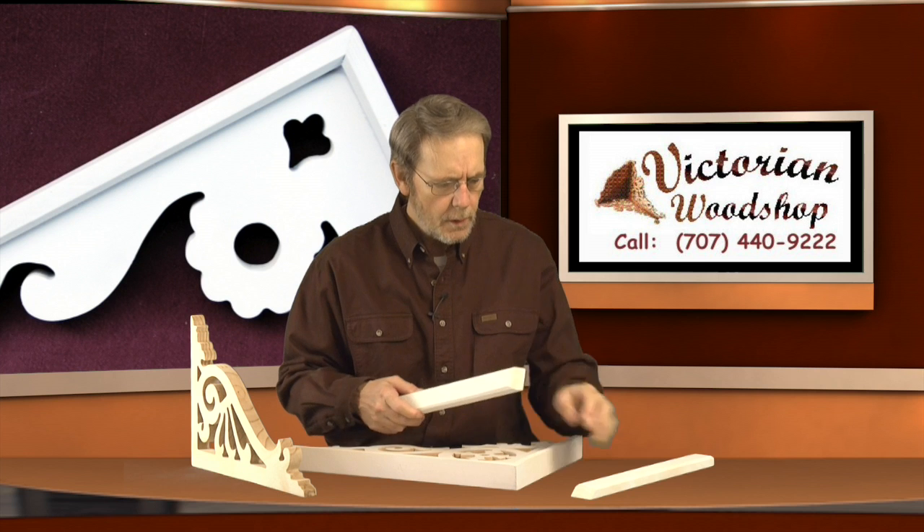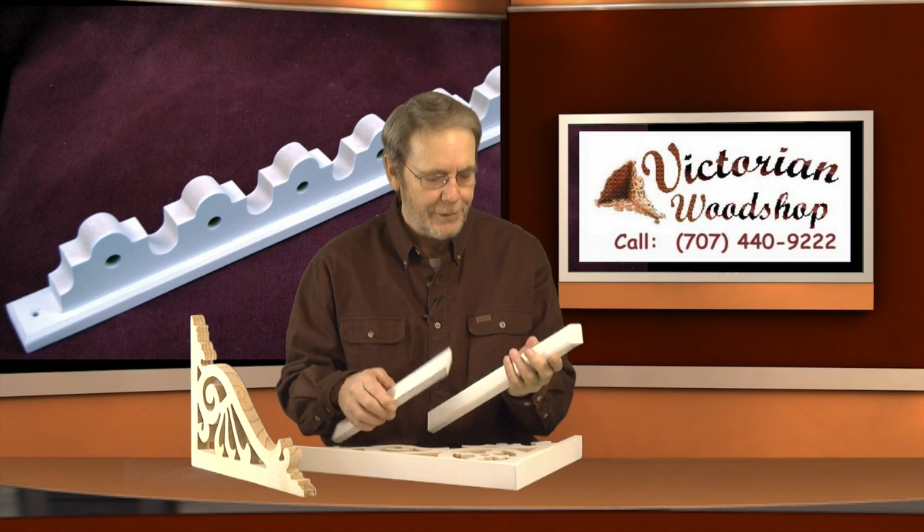I try to add some details to them. I cut them at a 45-degree angle so that when I put them together it has a nice detail up there at the top — it's one of those things you notice when you're walking by. I also do a bevel on all the sides so that it catches light and adds depth.